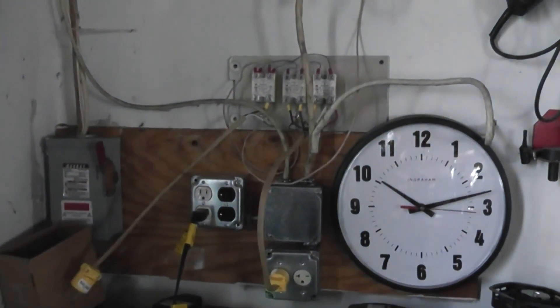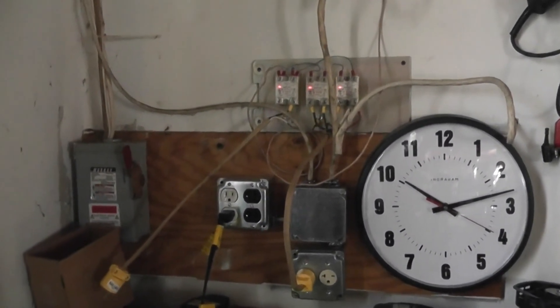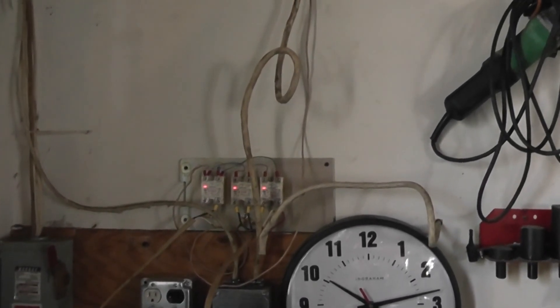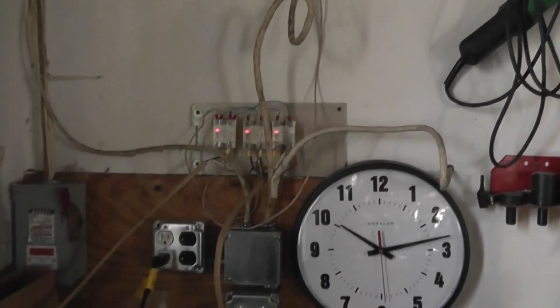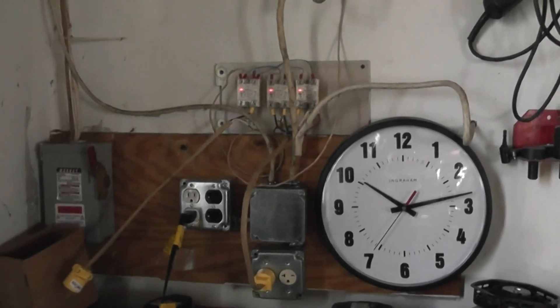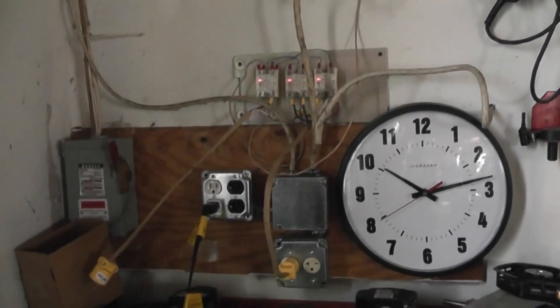There's a little bit of wiring. That big box on the left brings in the main house power from another inverter out in the shed. I'm going to add a couple of switched outlet boxes to these relays — and since they're lighting up, it means it's ready to start charging the car again. So we're just doing this little one or two minute cycle. It was able to start charging the car after declaring the house batteries in reasonable shape at 10 AM, even though I ran them down pretty good last night. This is a working setup.